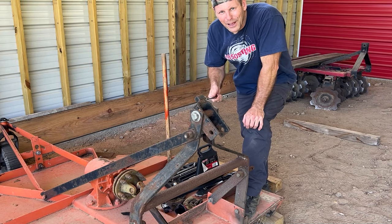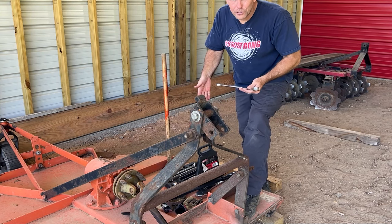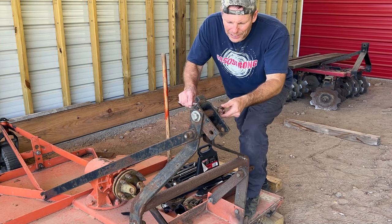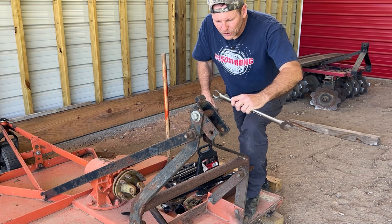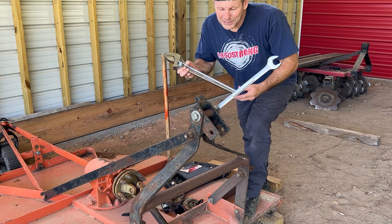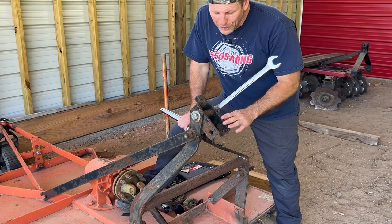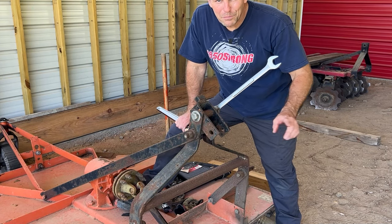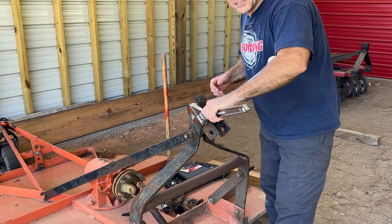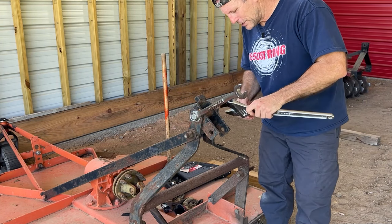So that's the difference between a three-point hitch implement that's not made to pivot and a brush hog that should pivot in the event it hits something. You remember the true Black Friday days when you used to get up early and be in line at four in the morning at Sears to get good deals? Well, luckily I got a set of these very large wrenches that go from one inch to one and a half inch. This nut right here is actually an inch and an eighth, so I've got the right size wrench. I've also got the crescent wrench to hold the other side. I'm going to use that big wrench to loosen the nut — first time I've used this wrench, got it for Christmas.